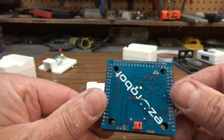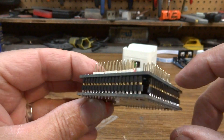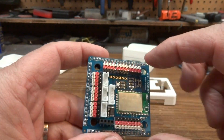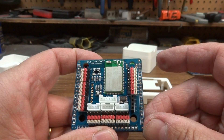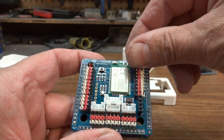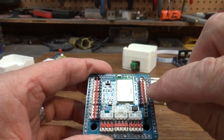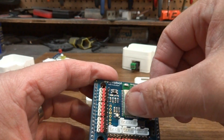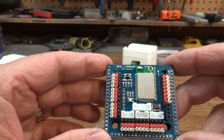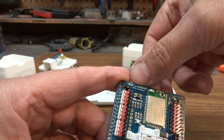The first thing I can notice is how neat and nice everything looks. These are all hand-soldered, I understand — right up in Canada. These are the first 100 in the batch. It's all nice and professional. This is a double board, kind of a shield style. I would imagine that says UART down in there. You have the white, red, and black — so you don't mess things up, you've got to match up your wires. White is your signal, red is your voltage, black is your ground. There's your camera connector right there. And it says Wi-Fi catalyst up on top with the EZB board.